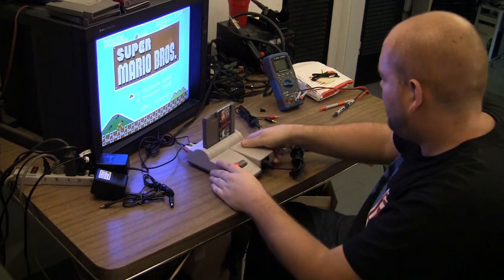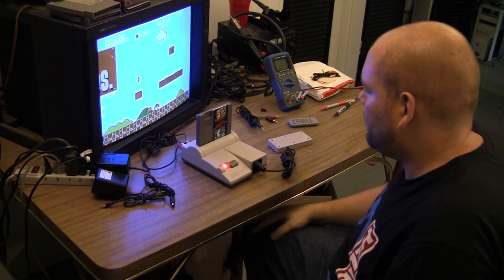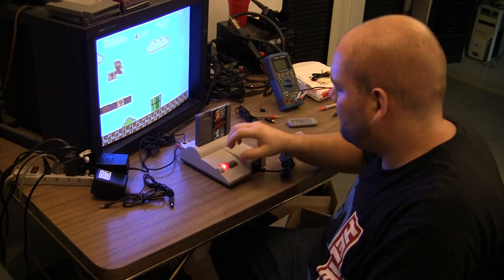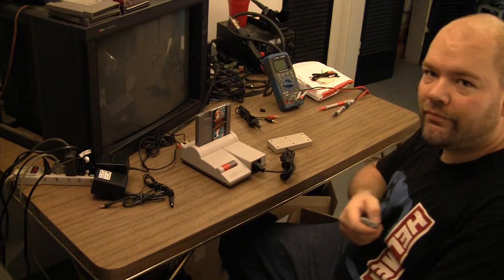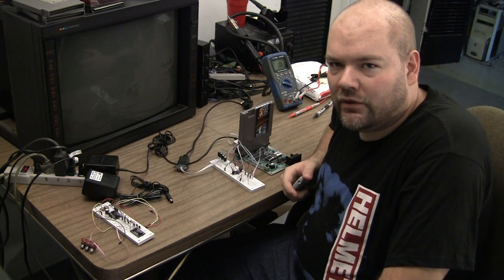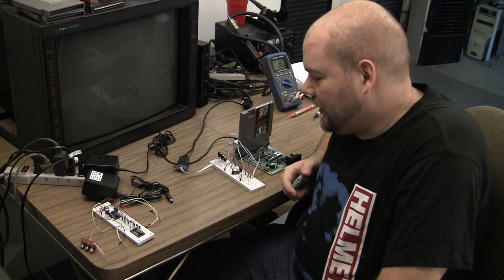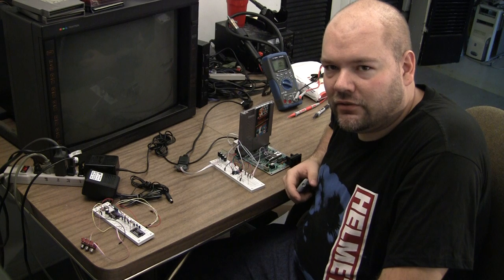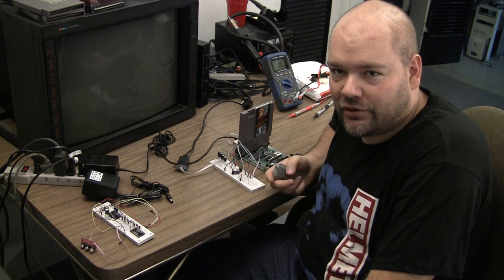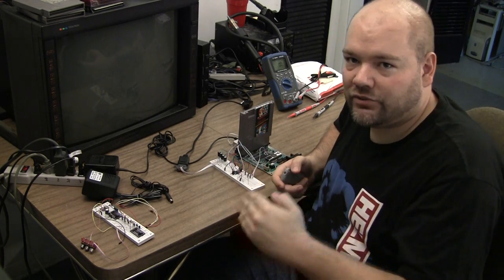Most likely, the inside of this will become quite cramped with trying to add a J-Rock board and an RGB amplifier and an RGB PPU, but we'll see how it goes. Okay, first things first, desolder the PPU and place the PlayChoice 10 RGB PPU in. And I like to test RGB first before hooking it up to component.